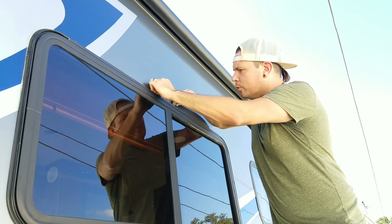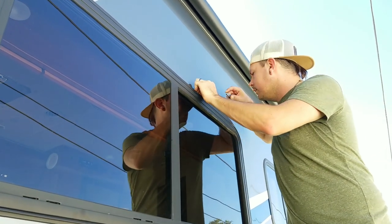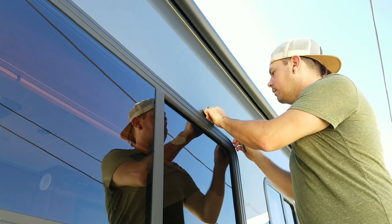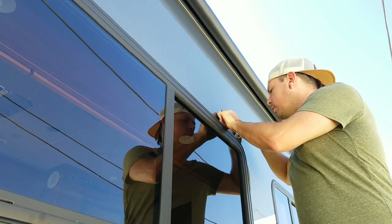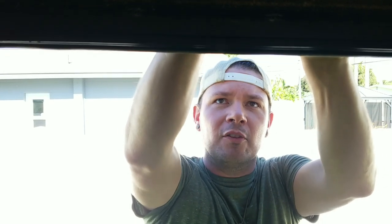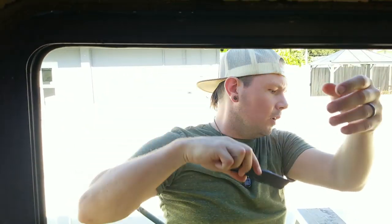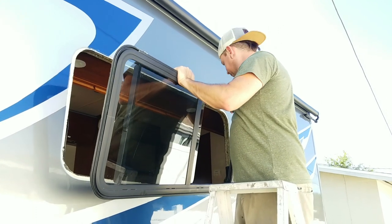Right now I'm just cutting through the old sealant, and once I get it down I'll scrape and clean. Oh look — there's another huge gap right here. The window's about to come out. This window had zero — might as well say zero — sealant around the top of it. I'm getting the scraper in behind where the gasket and seal sit inside the frame, getting it off the wall. I'll run the scraper behind the window frame until I get to the other side, and then it should start — like that. There it is, it's out.